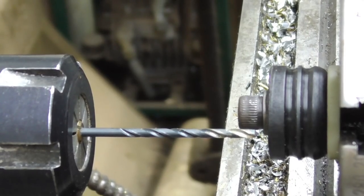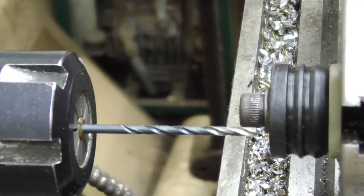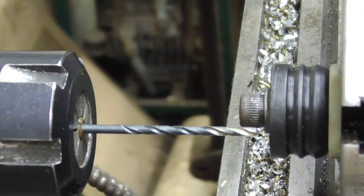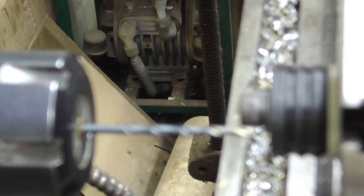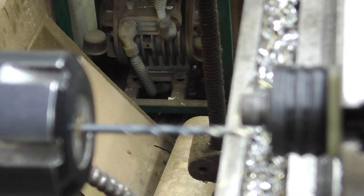Okay, we're going to make up the body for the plug. I've got it set up in an indexing head that I can rotate. And we've got the diameter set for 7/10 inch, which is the diameter of the hole pattern. And we got our drill bit for the size of pin that we need. Okay, and I've got it set to 0. And we shall drill holes.